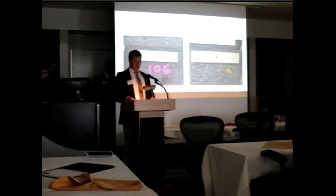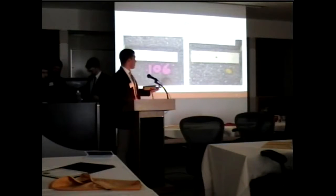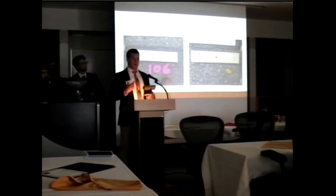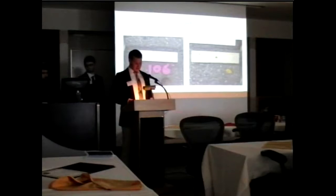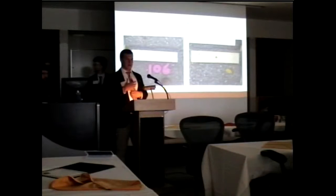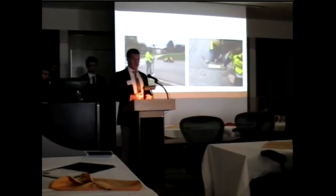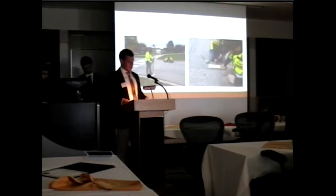The targets for our control were made of reflective road tape. We used the board on the right screen to add a template so we could get the exact dimensions on each of our control points, so extraction software can easily identify the center of each control point. Within the board is a hole in the exact center. We drill and pound a mag nail and then shoot it with GPS to get the control points as well.